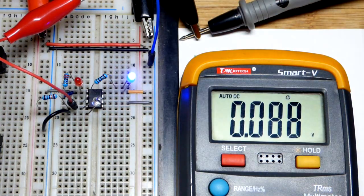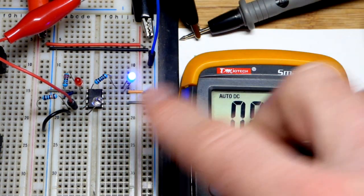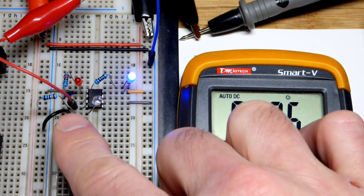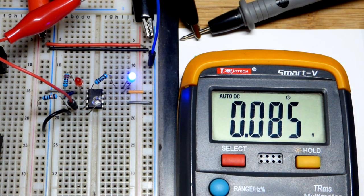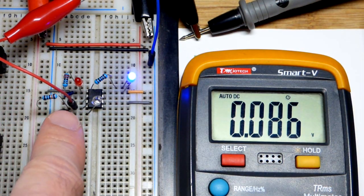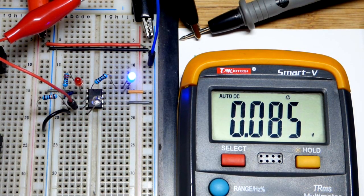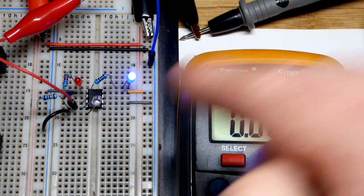About 0.5 volts is where we have our switching threshold. When it's dark you can see how high the voltage gets. When it's dark, the photodiode barely passes any current; when bright, it passes a lot. The pull-up resistor's current gets pulled to ground by the photodiode. When the photodiode is barely conducting, even a 100,000 ohm resistor can supply more current than the photodiode lets through, giving you a high input to the reset pin.